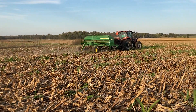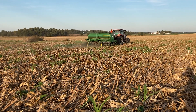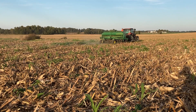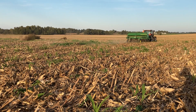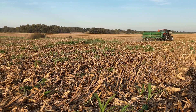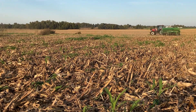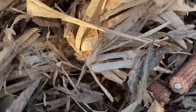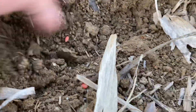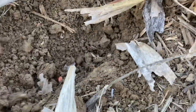This is a Precision Planting prototype drill we've been using for a few years. It has SeedForce with row-by-row sensing, so it's sensing down pressure on a row-by-row basis and making adjustments on a row-by-row basis. It's a system we really like — we don't sell it — but we really like it for achieving more consistent seeding depth within heavy residue, and most of the seeds are getting into the ground at target seeding depth.